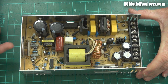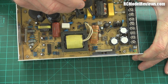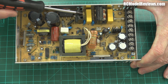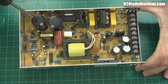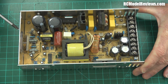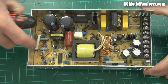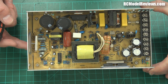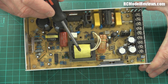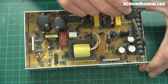Here's what's inside this one - it's a bit more industrial strength. Down here we've got some capacitors, a common mode choke, and some MOVs, which are things designed to stop nasty voltage spikes coming down and ruining our day further up the circuitry. So this has got much better input voltage protection than the Hobby King unit. We've got our bridge rectifier, then some capacitors - these are Nippon Chemicon. At least it says they are; they might be counterfeits, you never know. But Nippon Chemicon are very good brand capacitors, so these will last a long time. Then over here there were some switching transistors, but these are the bits that broke because when they built it they didn't tighten the screw to pull them hard against the back of the case, which acts as a heat sink. So after two and a half years they got hot and died.